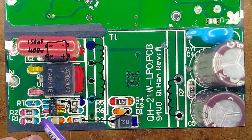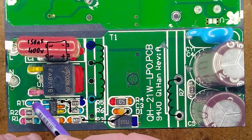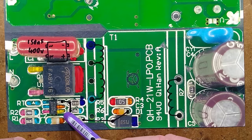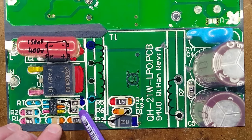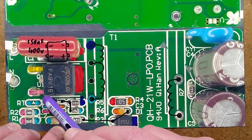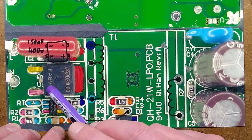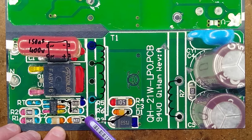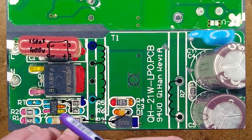If the link had not been shorted, the temperature threshold would be 135 degrees Celsius, but you can change the resistor to set anywhere between 79.4 and 135 degrees. There's a feedback sense resistor divider and a really odd little rogue track — it's a screening track with no resist over it, so it has a slight layer of solder. It's possibly designed to prevent tracking or leakage across the circuit board from the MOSFET to the sense circuitry, but it does compromise electrical separation.